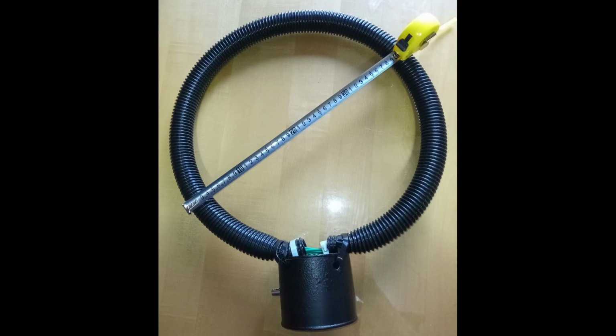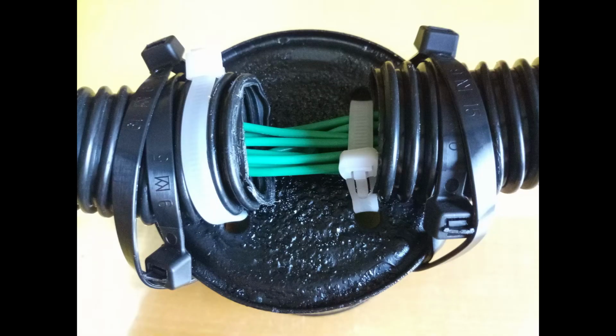The radio works well with the wire antenna, but only for the 50 and 25 meter bands. For the medium wave, or broadcast band, it is necessary to use a loop antenna to reduce the amount of noise received. This loop antenna appears to offer a good compromise between effectiveness and size. Larger loop antennas would work even better.